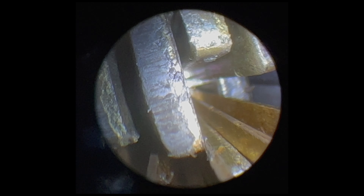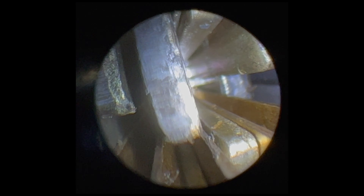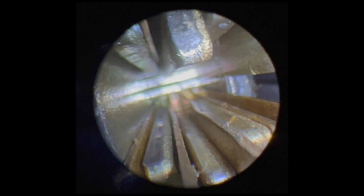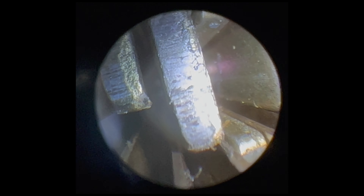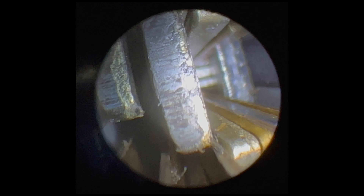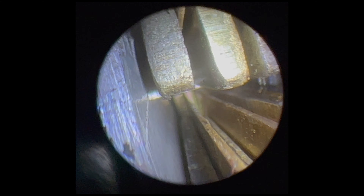Five, four, three, two, and one - and all of a sudden they'll start to bind up. Something has just allowed the bolt stump to move forward a little bit. The lock has now jumped into an anti-pick. On the back there is the bolt stump - you can see the V-notch - and levers three, two, and one are all basically in their anti-pick notches. Let's go to lever one and see whether we can notch that up out of its anti-pick.